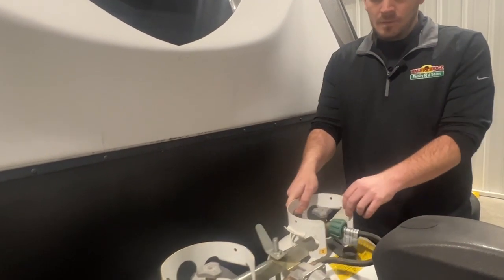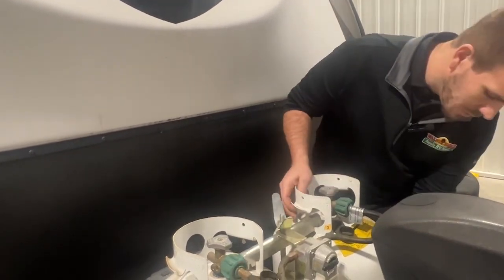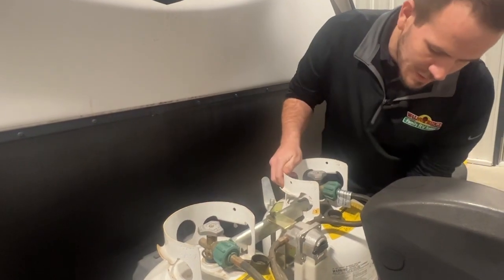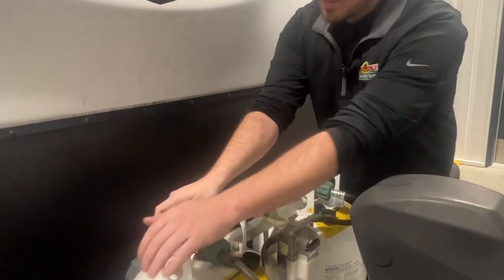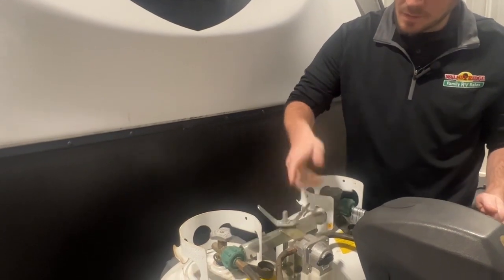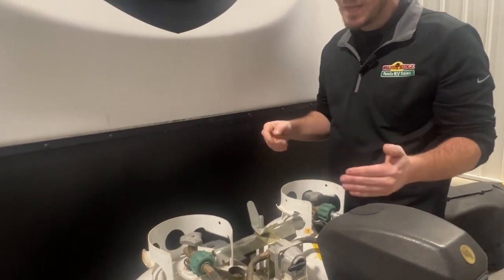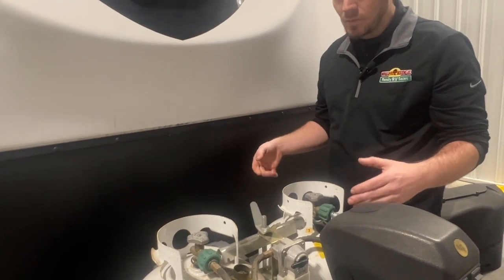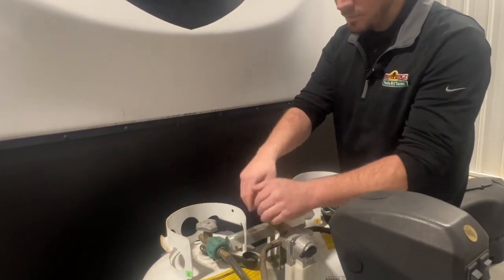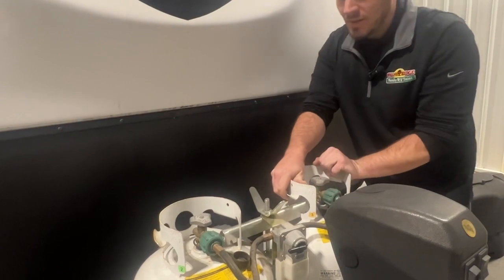As you can see, those are not secure. You have the twisting knob on the top that will lock the bar down and keep the tanks tight. So what you want to make sure is that you get your tank into the tray, and it's not sitting up on one of the lips. You get it down in there securely. You get the bar that's holding it into the notch, and then you tighten it up. The regulation is that it takes 8 times the weight of the filled cylinders when you're pushing it. So it should be able to take 8 times the weight of whichever tank you have, both of them combined filled weight. It's kind of confusing. Just make sure that it's tight, and that you can't just wobble it around.